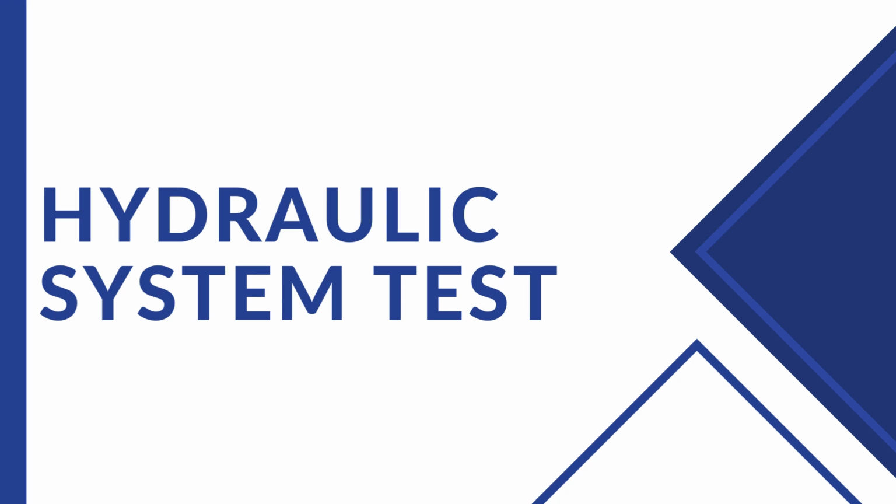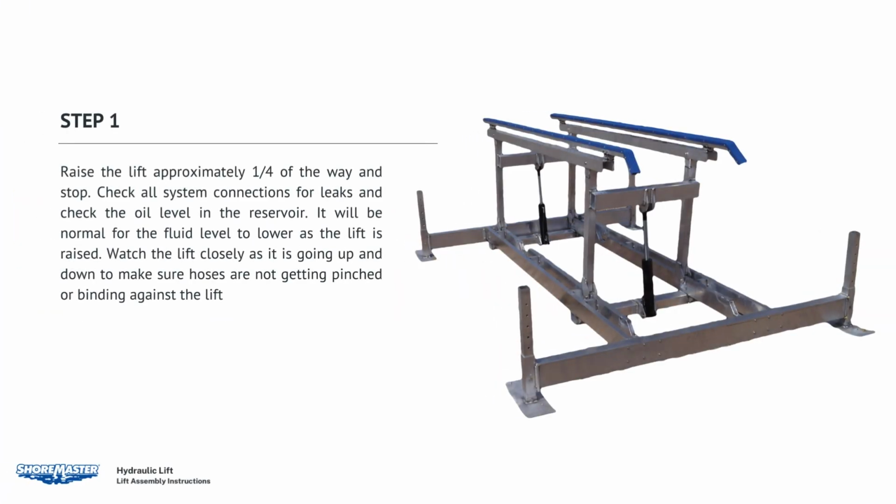Hydraulic system test. Raise the lift approximately 1/4 of the way and stop. Check all system connections for leaks and check the oil level in the reservoir. It is normal for the fluid level to lower as the lift is raised. Watch the lift closely as it is going up and down to make sure the hoses are not getting pinched or binding against the lift.